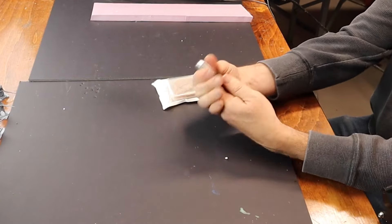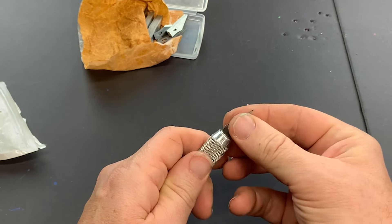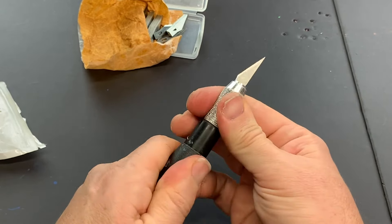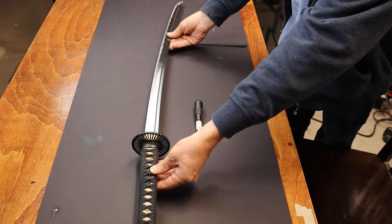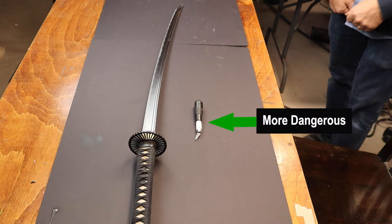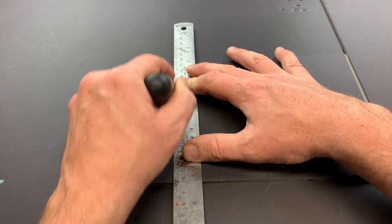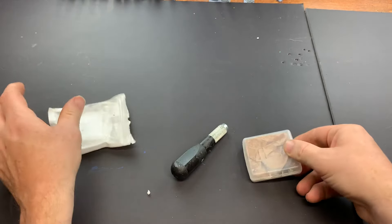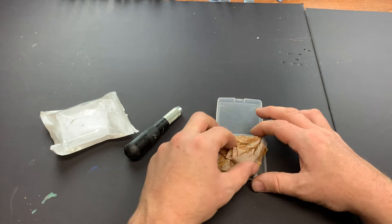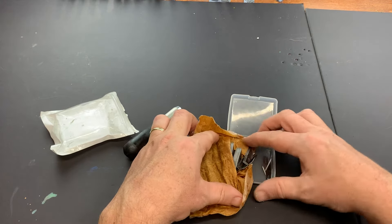The key is to replace your blades constantly. Don't mess around — at the first sign that the blade is dull, just replace it. Your cuts will be better and, most importantly, it's safer to use a fresh edge. I know this might sound counterintuitive, as a sharp sword is more dangerous than a dull one. But the real risk when cutting building materials is not where you intentionally direct the edge, but where it goes unexpectedly. A sharp blade will not stutter in a cut or slip on the surface, causing it to jump from your building material into your waiting fingers. Because you need to change so many blades, I buy mine in bulk, usually in a pack of 100. I'll put an affiliate link in the video description.